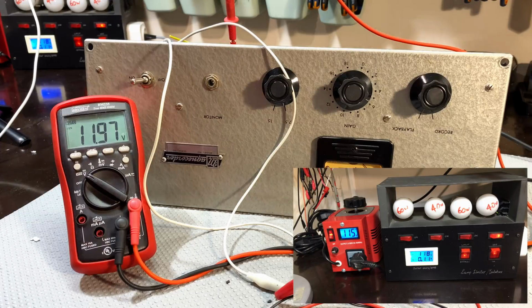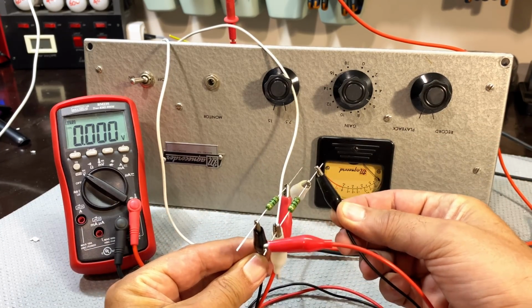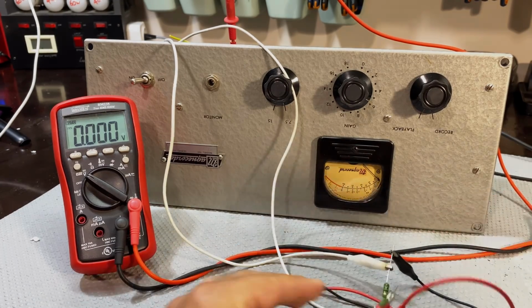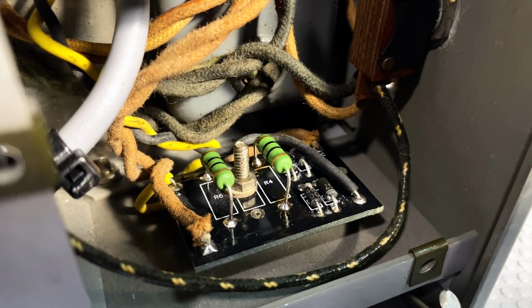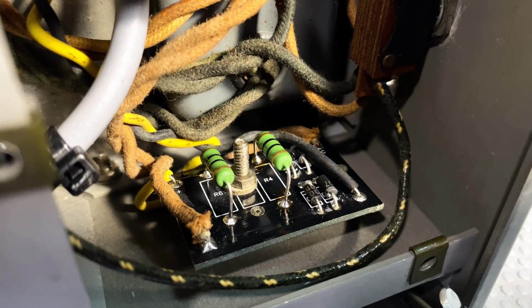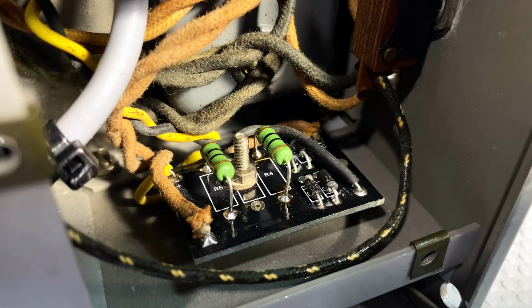So what I'm going to do now, switch it off, and I'm going to solder these 2 resistors in parallel onto that board, and our heaters will be fine. Let me get on with that. And there we are. 2 resistors in place. If you notice, the central one, I've actually drilled through it to bolt it to the chassis with a spacer. I knew I wasn't going to need 3, so I've got 2 2-watt resistors. That's 4 watts. It's dropping about, I don't know, 2-3 volts, not more than that. Probably less than that. So I've got no problem with power. So my heater supply is done.